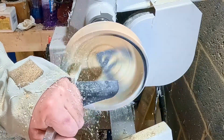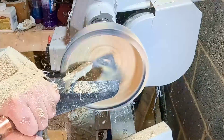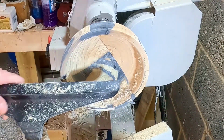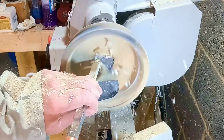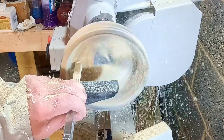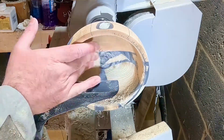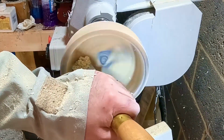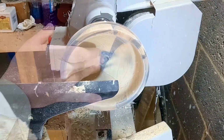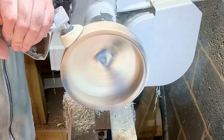Centrepiece removed, the rest was nice and easy. Using the carbide cutter to remove the high spots and fine tune the inner surface, ready for a final going over with a large negative rake scraper. Final check to feel for any inconsistencies, which are dealt with using the scraper, and it was time for sanding from 80 to 3000 grit.